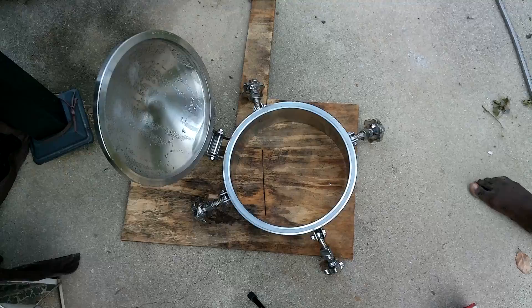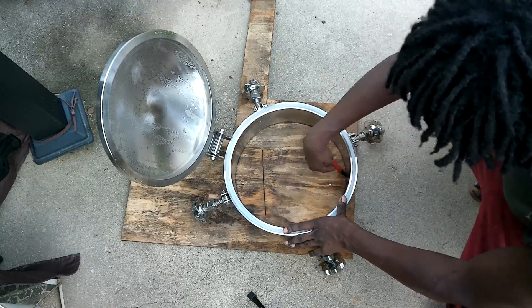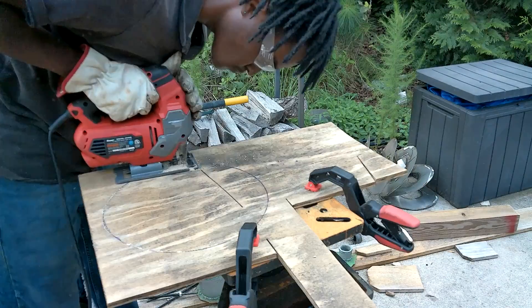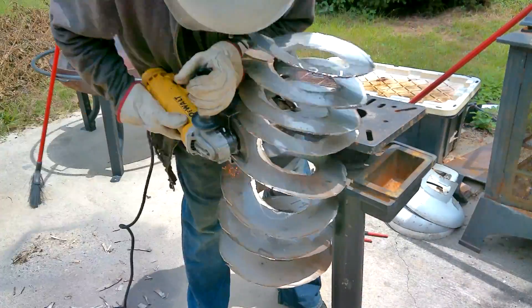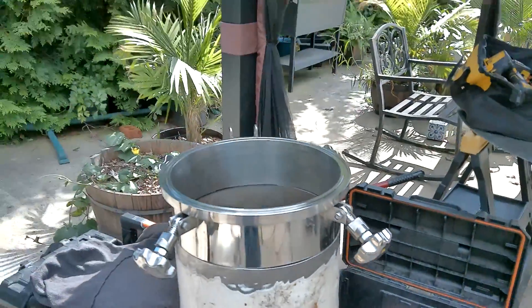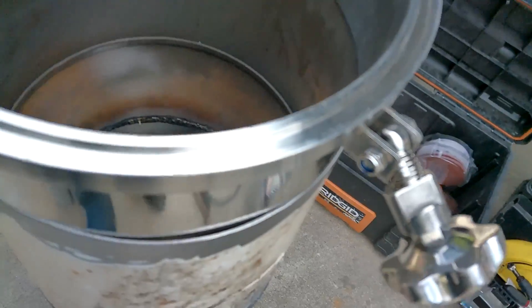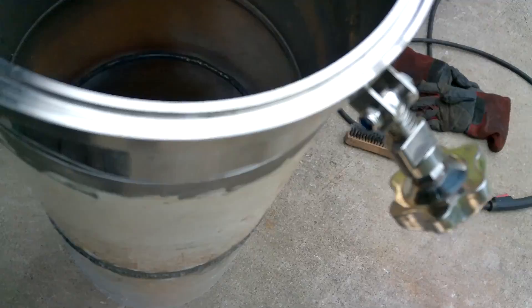So this here is the Manway, guys. This is stainless steel 304. I ordered it off eBay for $200. Right now I'm tracing a circle on wood because when you weld these things you don't want it to warp, so we'll use the wood as a heat sink. Copper or aluminum is better, but this is the best I got — and I don't want to cut a circle out of metal. Now it's a matter of getting this Manway on there. Unlike the other things that were cut by hand, this Manway was made properly, but somewhere is a little bit off because we do have some gaps. Not a big deal — I can fill in gaps, especially with thicker metal. As long as everything is even, that's what I care about more than a gap.